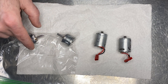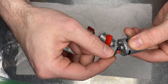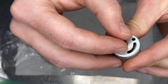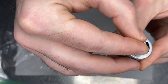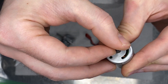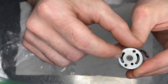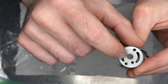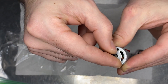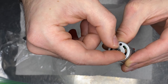I took the gearboxes off the motors. This is the good motor and this is the bad motor. Just looking at them — you can see a decent set of motor windings in the good one, but when you look in the bad one, it looks like some sort of adhesive was applied, because this one has a very poor, loose winding job. It looks like instead of rejecting it, they just tried to glue the windings down.